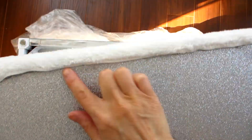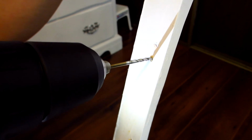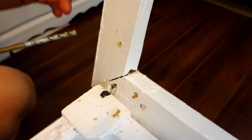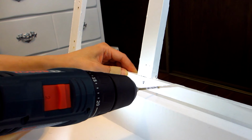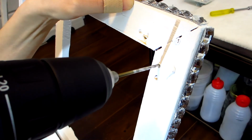And here is what the seat looks like with the entire wood panel covered in the microfiber cloth. I ended up applying two cloths, one over the other, just to make it a bit more plush. Before we can reassemble the seat back onto the bench, we are going to prepare the frame of the bench cover with some new screw holes. Here you can see I am pre-drilling holes to allow for the countersinking, approximately every 6 inches all around the frame. This allows you to hide the screws with some spackling after the screws are drilled in.